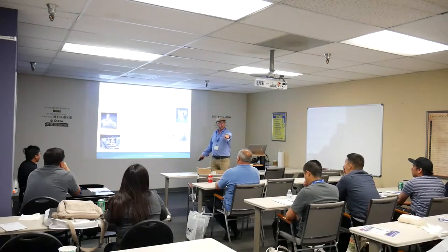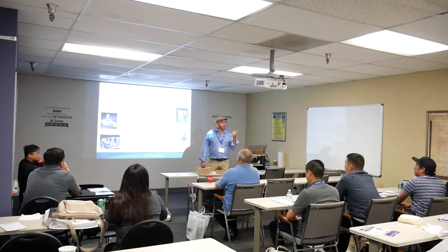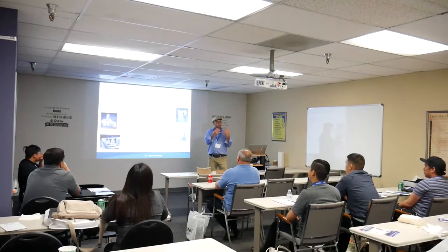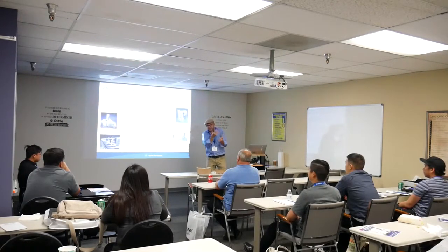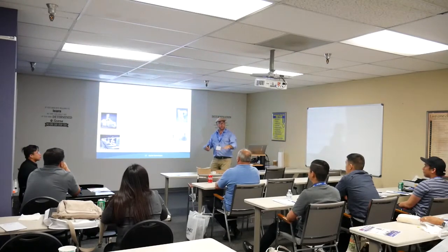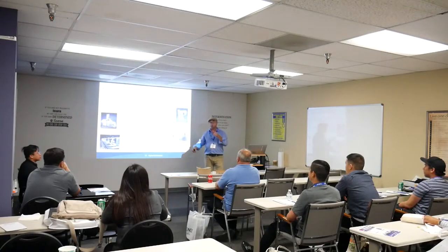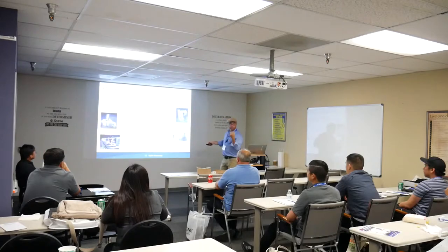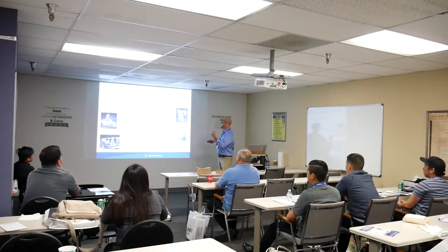For someone in the water department who needs to evaluate water quality — chromium, different chemistries, metals — they need to vaporize, ionize, and accelerate those molecules. Agilent makes most of that equipment. It all has to be under vacuum to get the resolution needed. The better the vacuum, the better the resolution. The only way to ensure vacuum is to leak check the system.